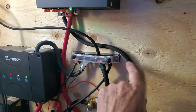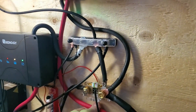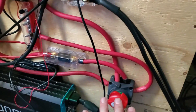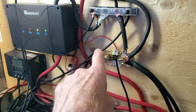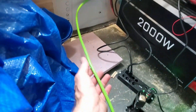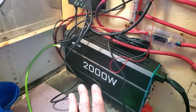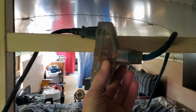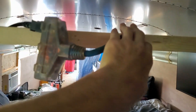That ground wire is a little on the warm side — I've got to change it because it's actually burnt on the inside, but it's the only spare I had. I've got everything going into a cutoff, except for this one which goes direct to battery. I've got a 300-amp fuse on the batteries. Right now I'm just running extension cords — I still have yet to hard-wire the AC side of it. I already burnt the first extension cord, but I did that at my shop.